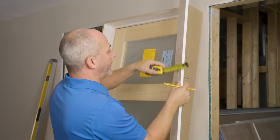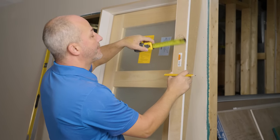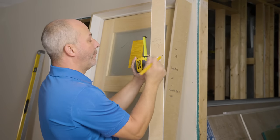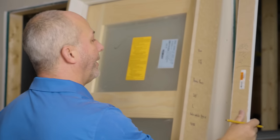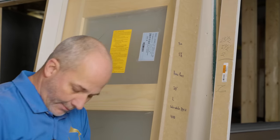Plus the width of the casing — two and three quarters — twice. There's five and a half. Plus I want to have a one-inch overhang on the top on each side. I'll show you what I'm doing in a second. That's 36. Now we're going to go to the saw. We're going to cut the header because with the header cut, it makes this install really, really easy.